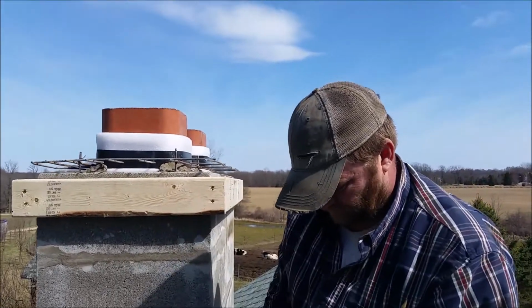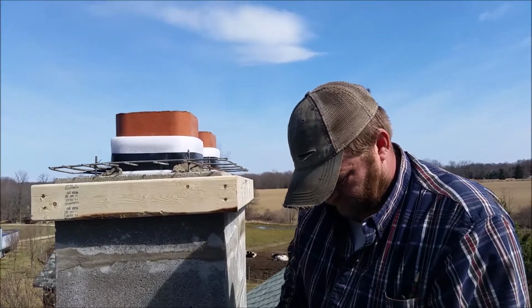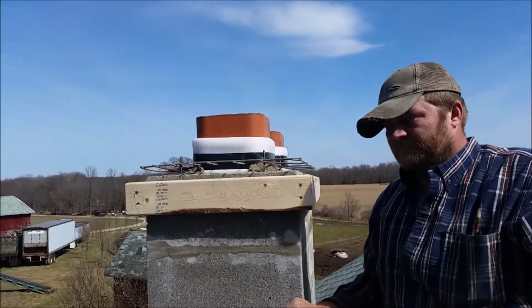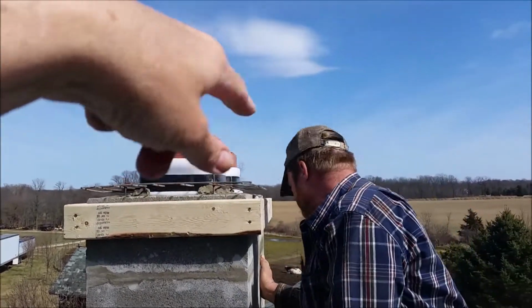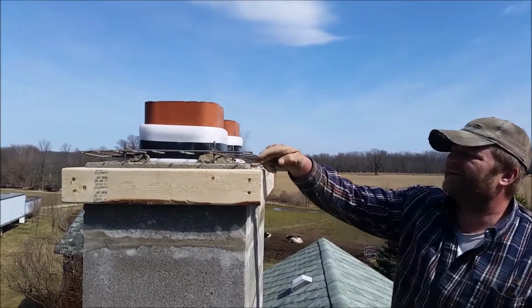Oh, they make a special concrete form oil. We're going to be using tractor hydraulic fluid because it's what we have. The wet concrete will stick to the wood, so you want to make sure that you coat that or you're not going to get it off. And he filled all of his creases where the 2x4s come together with some drier leftover concrete.